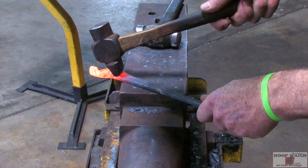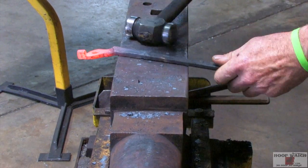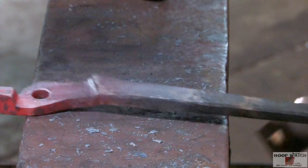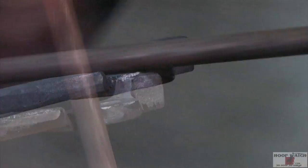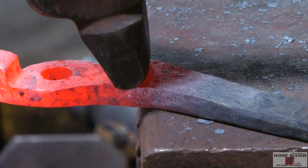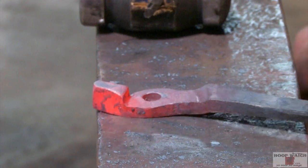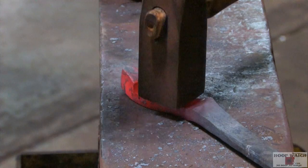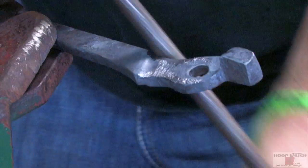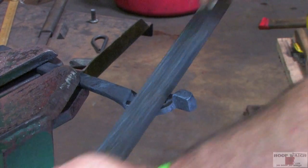So we're going to hold it up here. We've got a nice sharp, tight corner — just heat it ever so slightly, just flatten it up. Offset it — that gets some offset in there. Then ever so slightly get this side right here. All this has got to be cleaned up in a nice soft line so that they don't hang up right here. Take your file side and clean up all this. The smoother these surfaces are, the more they'll articulate nice and free.